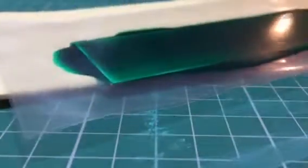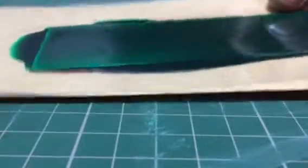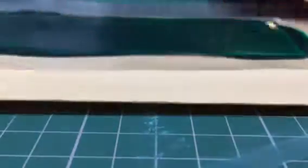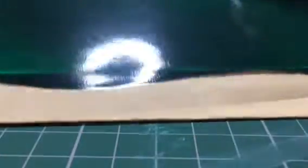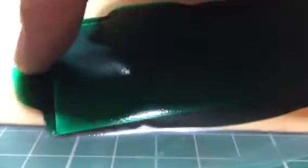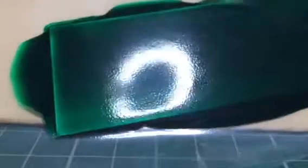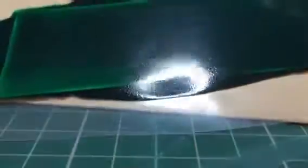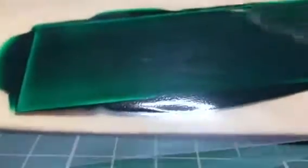This is the last of the video - I just pulled it out of the oven. I'm trying to find the right camera position so we can see if we can separate these bits of plastic. When you spread out the ink you get runoff and goo - it's quite thick here so the ink is probably not cured, still wet. We're looking for the thinner area on the board to have cured and provided a nice shiny finish. It's been in the oven nine minutes total - six minutes on the upper area, then I turned the board around.